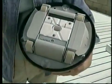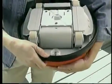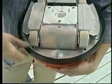Check to see if the ring at the base of your pool cleaner rotates freely. Should the ring not rotate freely, just snap it back in place on the six wheels at the base of the unit. Pick up the unit by its handle and submerge it in your pool, removing all air. Once the air has been removed, connect the cuff of the leader hose to the Hayward above-ground pool cleaner hose connector. Release the cleaner and continue to submerge the hose sections into the water, removing all air.